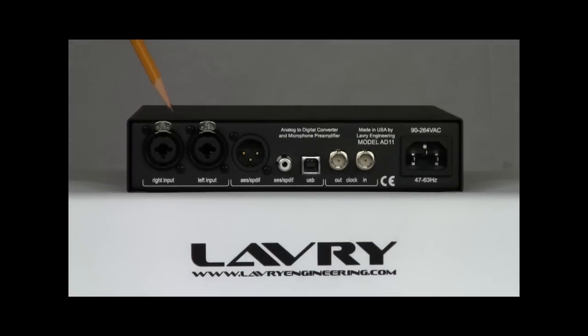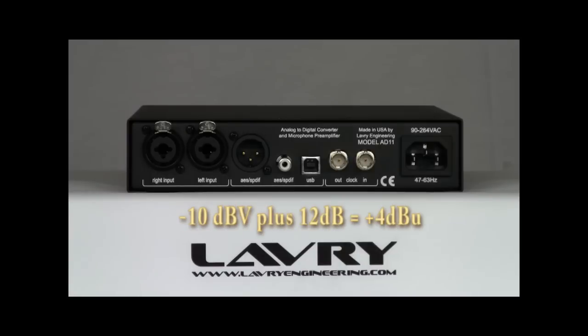The inputs are combo connectors that accept either balanced or unbalanced XLR and quarter-inch connections. The quarter-inch inputs automatically apply 12 dB of fixed gain for -10 level sources. With 12 dB of adjustable gain, this effectively provides a usable gain range of 24 dB for line inputs, taking the change from quarter-inch to XLR into account.